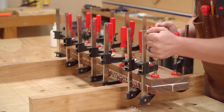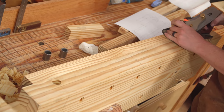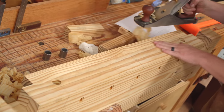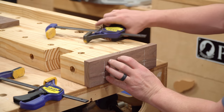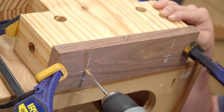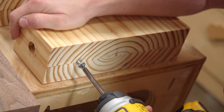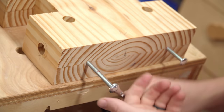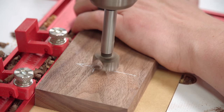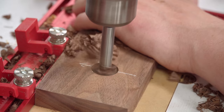While the glue dried I milled some walnut for the vise and end stops, then took a long lunch break — and possibly a nap in a hammock. I flushed the built up front face with a smoothing plane, making sure not to modify the original front face since I already knew it was flat and square. For the end stops: I made them slightly wider than the thickness of the top, clamped them in place with the top face down, and drilled a 3/16ths inch hole through the walnut into the pine. A quarter-20 bolt is driven through to establish threads, then thick CA glue and quarter-20 carriage bolts are installed. The end stops then get a 7/8ths inch hole drilled offset from the first hole so the top edges are touching — the smaller hole is completely removed by the 7/8ths bit.